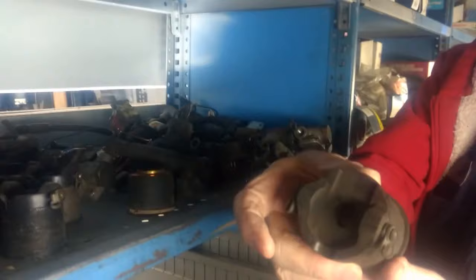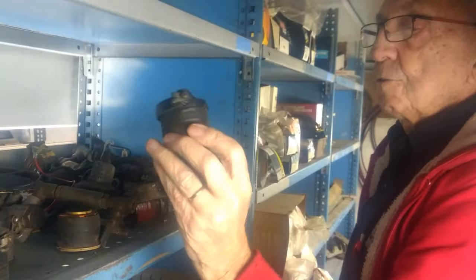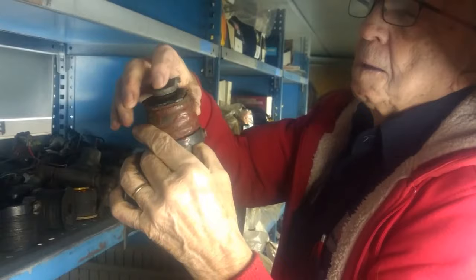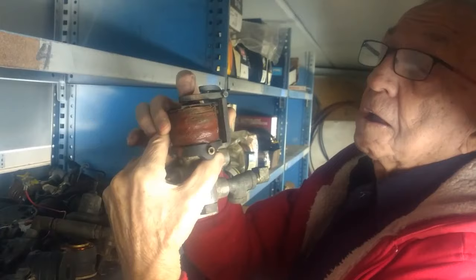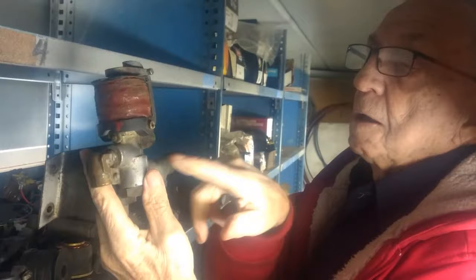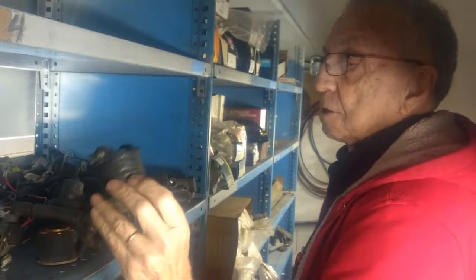Jeff has found a box of brand new magnet coils for the transit shifting mechanism. So we're lucky to have those, and we have some spares if you're working on a transit that has open coils. But they very rarely open. So 99 times out of 100, the coil is not the problem. The problem is these pinhole valves plug up. So you can see this armature barely moves, less than a 32nd of an inch. But down in here, the little pinhole is plugged up, so it's not moving air. And you're tempted to think these coils are bad, and they're not. But in case you have a bad one, we have some we can spare. No hoarding, it's only for a project you have.